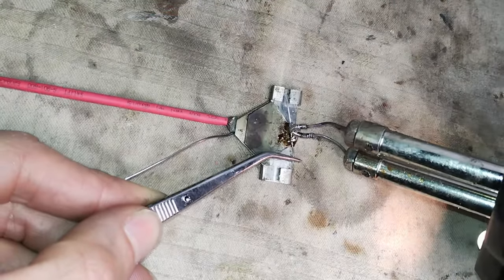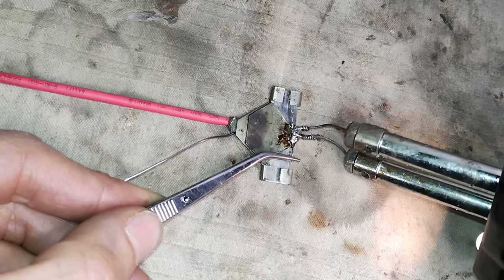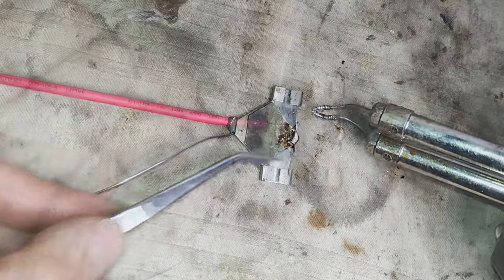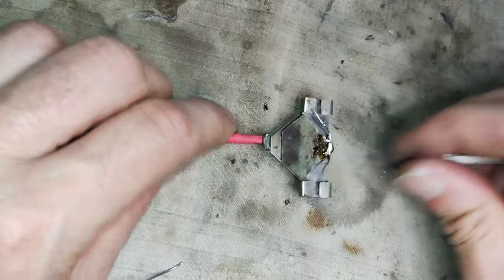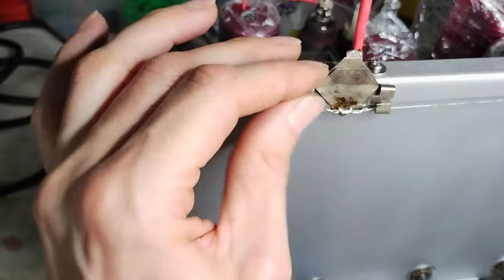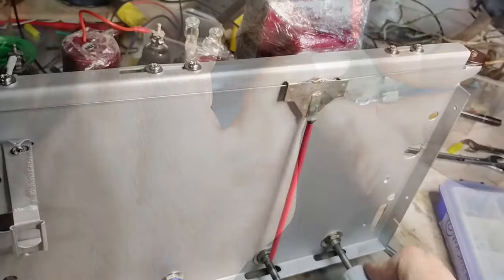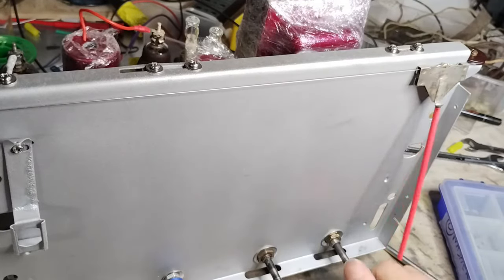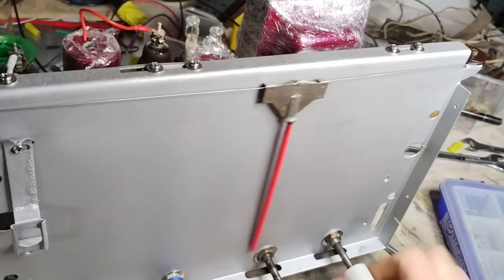Some red heat shrink pipe is used to make the dial pointer red again, and a piece of tinned copper wire is soldered, so that it could be wrapped around the dial cord, because it is not possible to solder the new steel cord directly to the pointer. If the dial pointer is installed correctly, it must be able to travel the whole width of the dial scale.